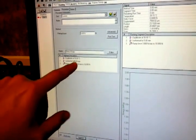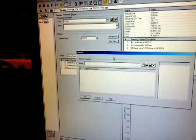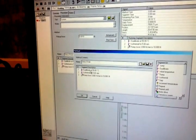Here you can edit your procedures. Right now this setup means it will heat up to 50°C to equilibrate, then isothermal at 50°C for 5 minutes, then ramp up to 80 newtons. If you want to change this, you can press edit. But if you are just doing a tension test — directly pulling — and temperature doesn't matter, then you don't need those temperature steps.